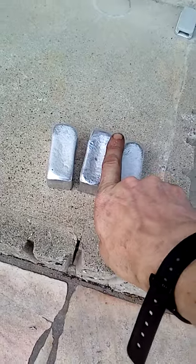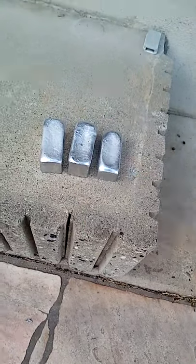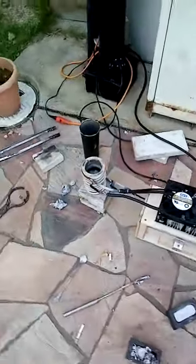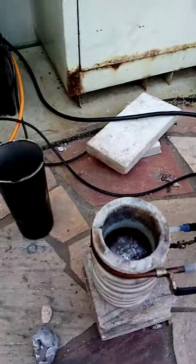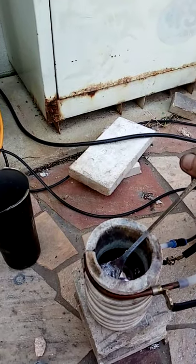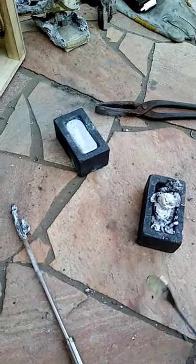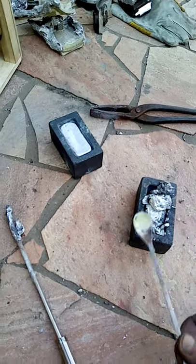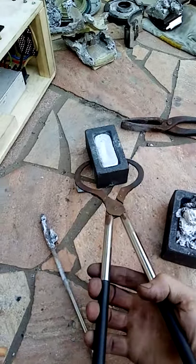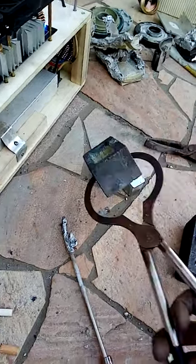There's my cooling tower. This is already melted this much aluminum, but they're like three-inch blocks — three inch by an inch to an inch and a quarter. They're still hot. Induction furnaces melt quickly so this batch is already finished. I take out the stuff on the top with a spoon — aluminum doesn't get as hot as copper. I put it inside this graphite block that I carved, and it's perfectly square inside.